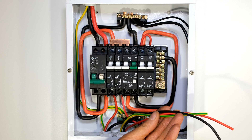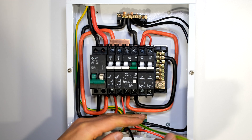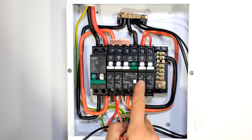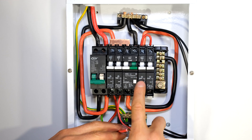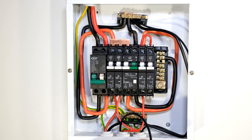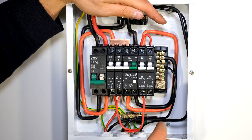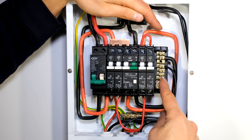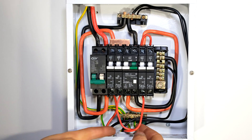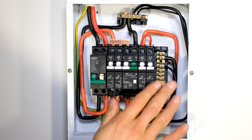My final circuit is the plug circuit, which is the circuit I want to have earth leakage protection. I'm first going to connect my earth to the same common earth rail. I've connected the earth to the earth rail. Now I need to connect the live to the output of this 20 amp circuit breaker — this is going to be protected by earth leakage. This is my plug circuit and this is the neutral for that plug circuit. This particular neutral is the one that's going to be connected to this neutral rail, which is the same neutral rail connected to the output of the earth leakage. I apologize for these wires looking so messy — it's just because we use flexible wires so we can keep reusing it in the lab. I'm now going to explain the whole setup.